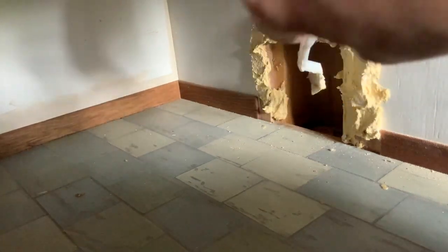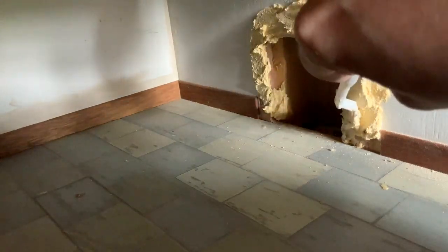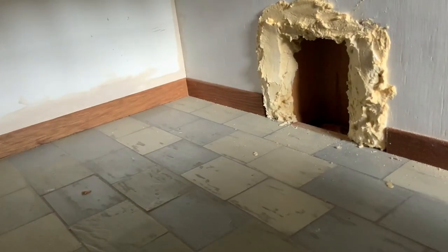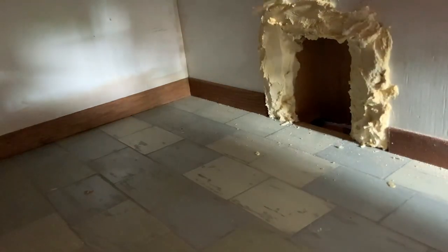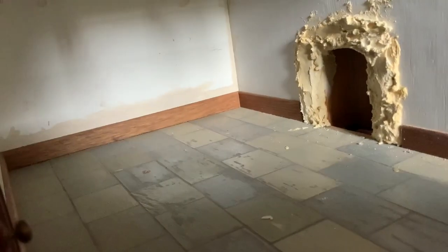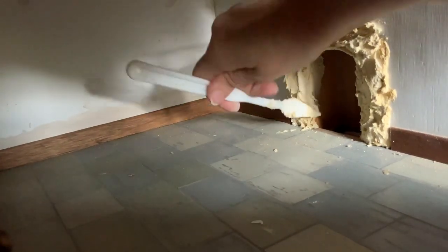I built the polyfiller up and gradually layered it until I had the shape that I wanted. Once I felt that the polyfiller had been layered to a thick enough depth, I then used the palette knife to smooth around the edges and to turn it more into the shape that I wanted. You can see here that I'm trying to smooth off the top and take away any excess to make it into more of a Tudor arch shape. I also did the same inside the fireplace to make that arch shape, and any bits that I felt were still missing I did a bit more and then reshaped them.